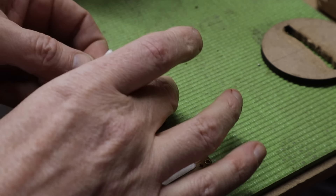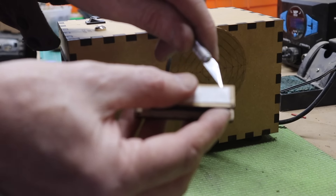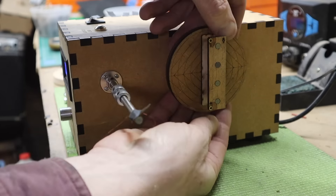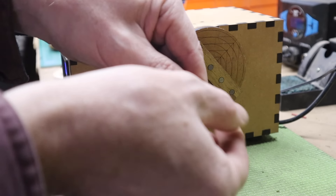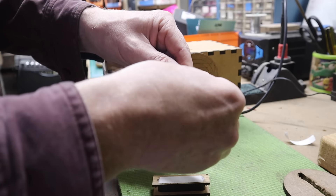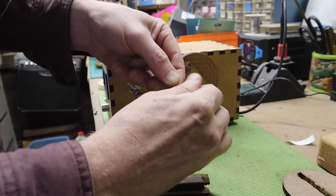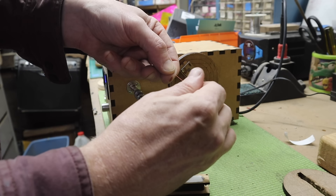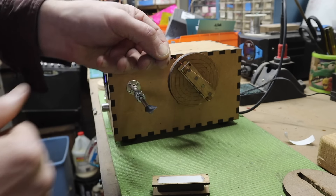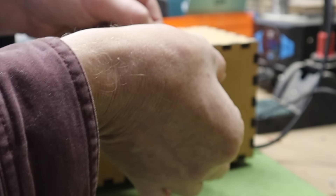I start by placing the spool on the floor and running the line up to my machine. I use two-sided tape for sticking my bobbins onto the spindle — I put it on the top side so I can access the ferrules on the back. I take my lead wire, twist it up and double it over to make it a little bit thicker and easier to work with, then slide it into the initiating ferrule on the positive side of the pickup and use a small piece of tape to hold it still.